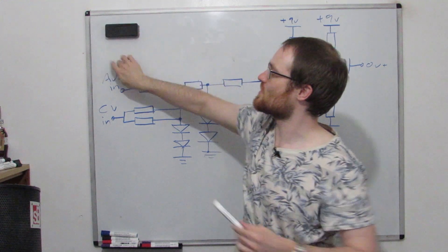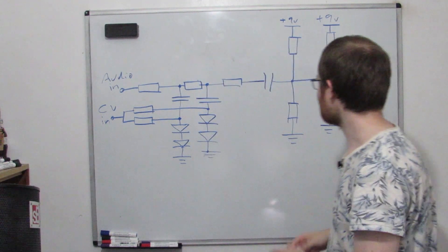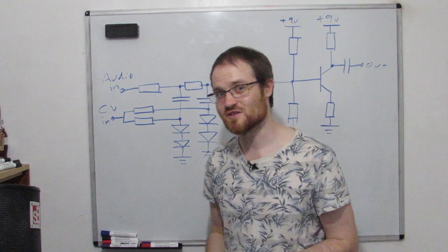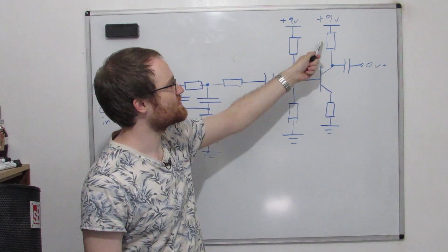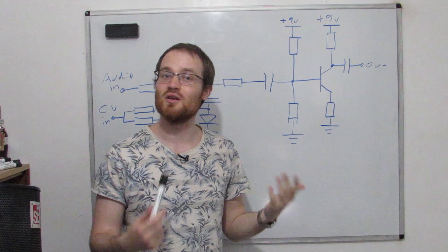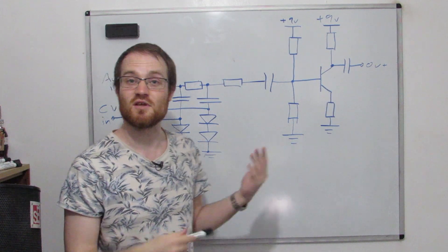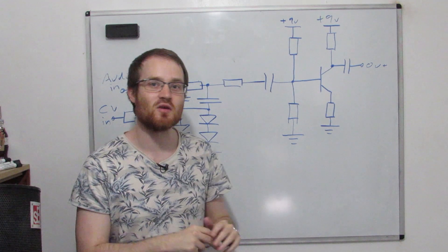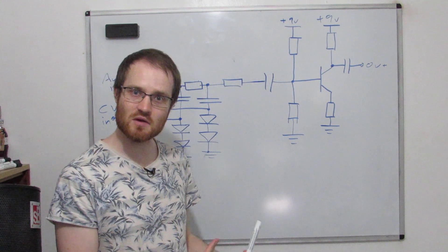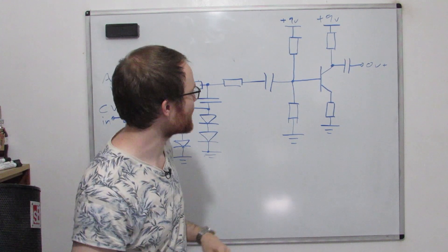Let's assume we've got a plus/minus one volt signal coming in, because that's what I'm going to use in this video. This looks very similar to what we did last time, and that's because it is. The big difference is that now we have a resistor connected to the collector — we call this a collector resistor or load resistor — and we're taking the output below that collector resistor. We're going to pick our operating point first. If you get lost it might be worth watching my last video where I go over these steps in more detail.